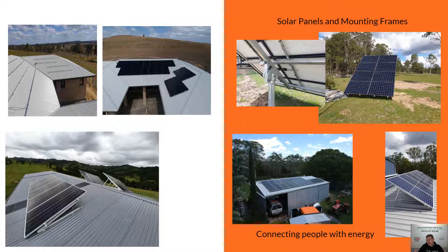With panels, there are different types and loads of different options on the market. The easiest way to remember it: blue panels are poly panels, and poly panels were designed to perform better in cooler climates. Mono panels are more of the black panels and they perform better in hotter climates — they handle the heat better than a poly panel. They also make black poly panels these days so it can be a bit confusing, but simply: poly panels are better for cooler climates and mono panels are better for hotter climates.